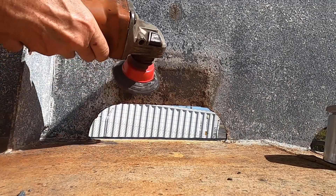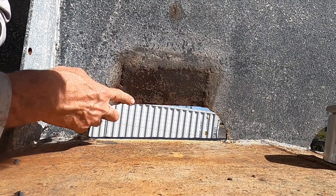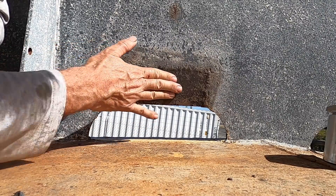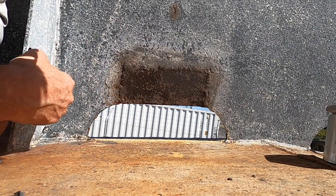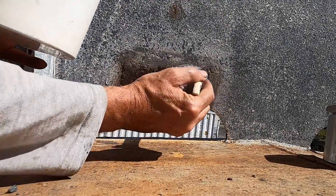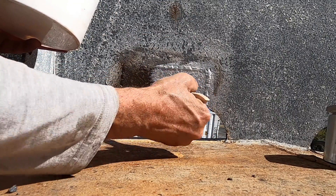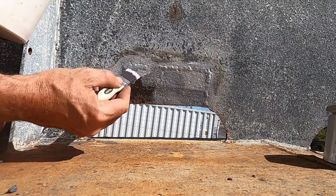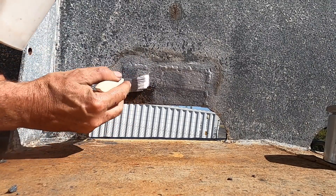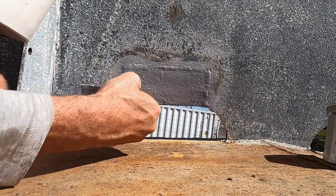Often, if you can't sandblast steel, you're actually better off letting it rust, have the mill scale come off, let the rust do a small amount of pitting, brush it, do a rust converter and painting. It'll actually stick better than if you paint onto new steel. Nothing loose is left on now, but I'm not going crazy, because if there's any primer that's not coming off, well great - if it doesn't come off with a grinder, it's not going to come off on its own. We want enough to convert all the rust, but we don't want excess - we have to wash the excess off. It's a bit like putting hardener in epoxy: not enough and you've got leftover resin, too much and you've got leftover hardener. Same thing - we don't want leftover rust, and we don't want leftover converter. Just cover it, see how it goes, clean it before painting.